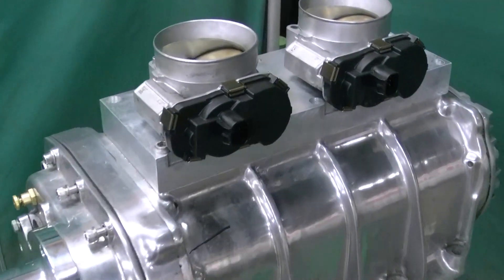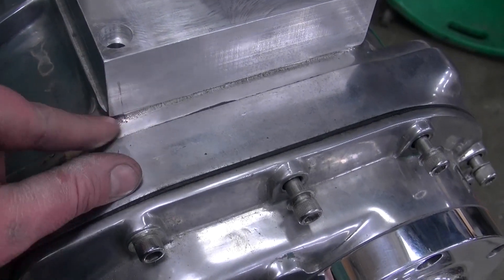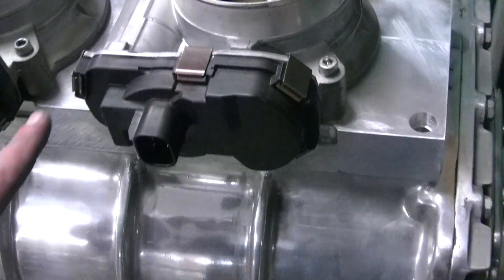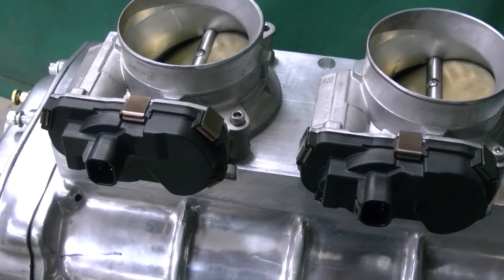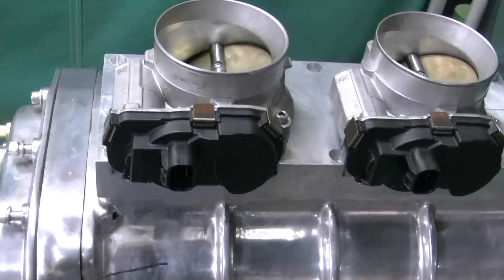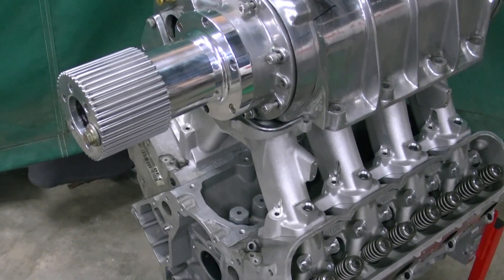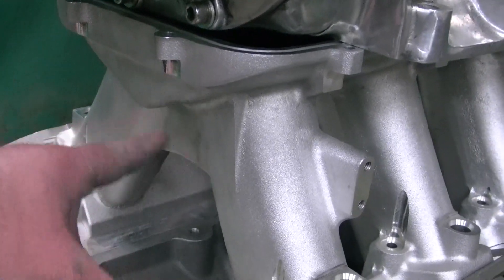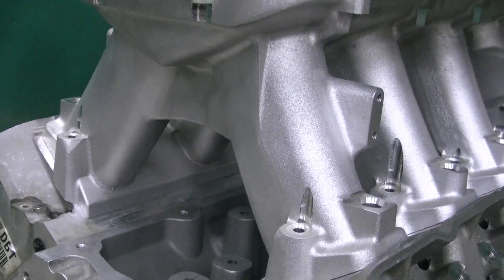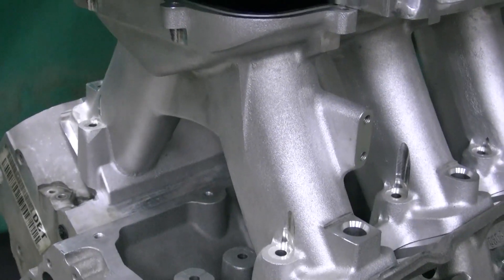You can see the top plate on the blower — everything's clear and good. I still got to get some more bolts for these throttle bodies, and I'll round these corners a little bit to match up, but everything is looking pretty good. I'm real happy with it. I probably have about eight to ten hours in that top plate so far and I still got to drill for injector holes and mount my injector rails. I ordered the wrong fuel rails and they're coming in the mail. I got my snout on there so I can start figuring out how I want to mount the blower. I'm also going to have to put an NHRA certified burst panel right here on the intake — one that just blows out, not the spring kind. I'll use the leftover aluminum from the piece I cut off to make that.